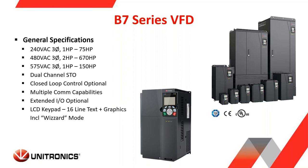With the B7, you can acquire optional communication cards that plug into the VFD, so you could talk Ethernet IP, CAN open, EtherCAT, and so on. We are also offering for the first time extended I/O cards — optional cards that can be added to the B7 series to supplement the standard I/O that comes on the VFD. The LCD keypad is a nice improvement, offering 16 lines of text and graphics, and the firmware for the B7 series now includes a wizard mode for setup upon initial power-up of the VFD.